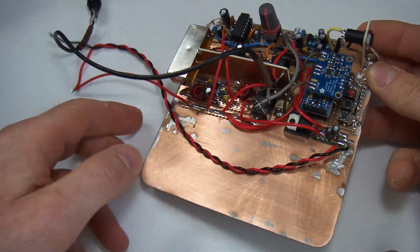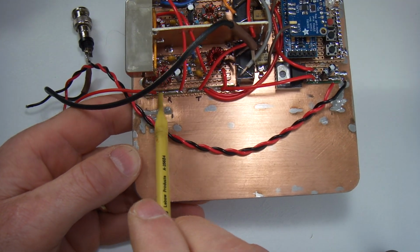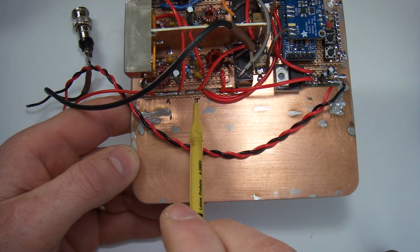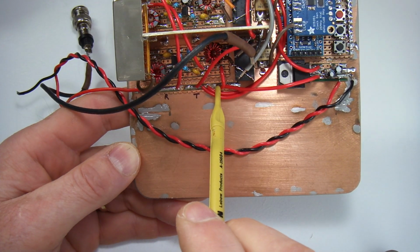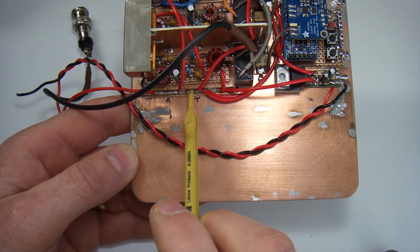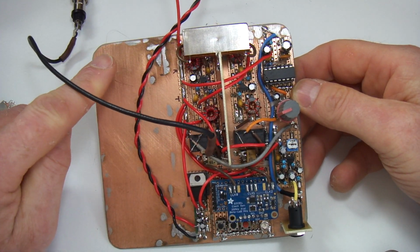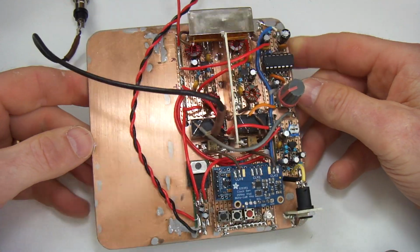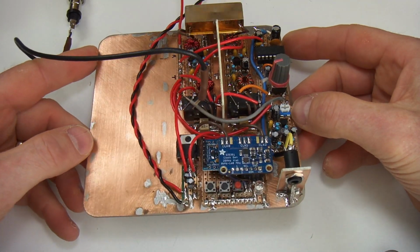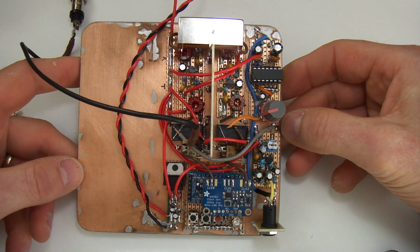What I've got down here is just a small, and I apologise, there's no real structure to this conversation, it's just more me rambling away. It's got a very small little strip down here with 3 segments: 12 volts, which is only on for receive, a transmit 12 volts, and then this little portion down here is fixed 12 volts, that's always on. So the relay will sense the transmit 12 volts, switch over, and then transfer that antenna from the receiver to the transmitter. So that's what I'll quietly work on in the next week or so. I've got a few other things I need to do, so I think the pace might slow down a bit, but it's all heading in the right direction, which is good.